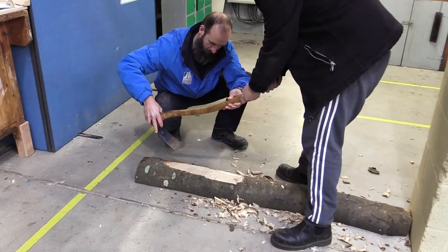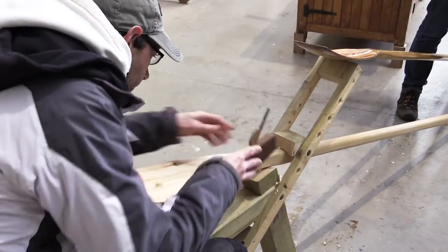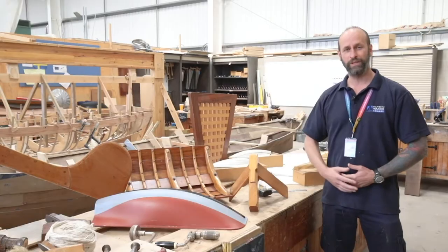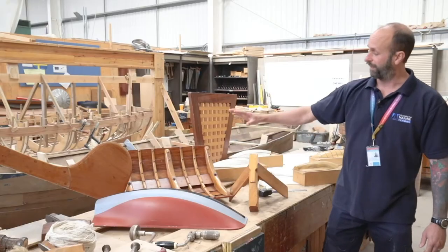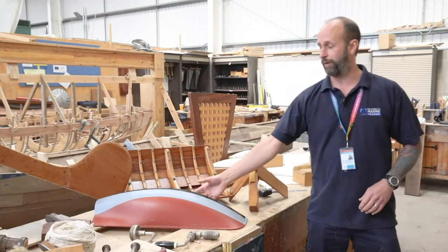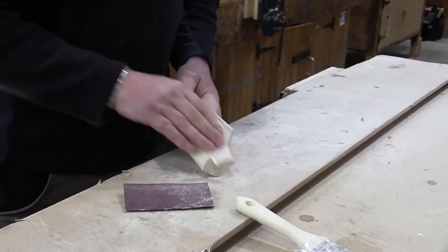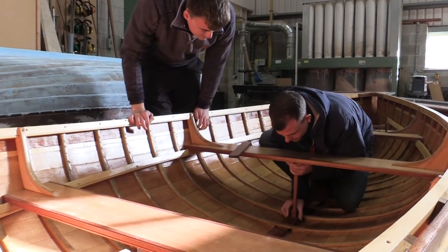Having learned a bit more about the design and components going into the boat, you'll take your skills from bench joinery exercises into more marine-specific tasks such as fabricating a yacht grating. Here we have a stem section, a detailed section of a keel part of a vessel, and things like a rudder. You may also get involved with fabricating a half model for a hull, which will take you further through the design process of how boats are constructed.